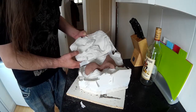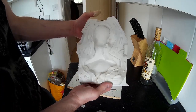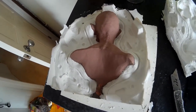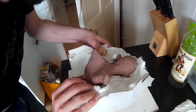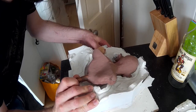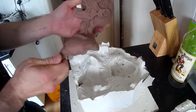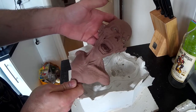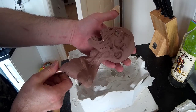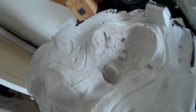There's the second half of my mould and it's looking pretty good. Opening the mould is always slightly nerve-wracking as you don't always get to keep your sculpture — they often break — but on this occasion it's come out pretty much perfectly with hardly any damage at all. I've heard you can only get about 50 casts out of a mould because the resin curing process can slowly damage it, so it's handy to have the original sculpture in case I need to make a second mould.